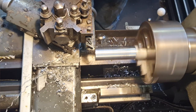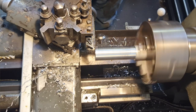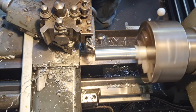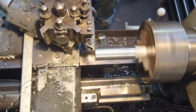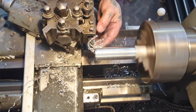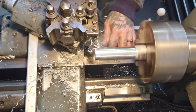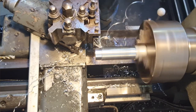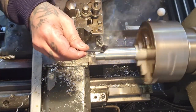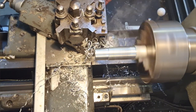Now down to — I always forget — it's 32 millimetres. So I'm gonna sneak up on it. I don't want that problem. Let's have a look, see what it does. 32, there. Not too bad. It's just thin shit coming off. We can live with that. Look — it doesn't get right round the job. Don't be fooled, it's still red hot — it still wants to hurt you. I'll take that down to 32 all the way.